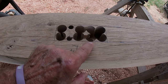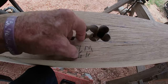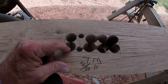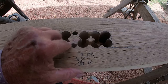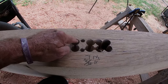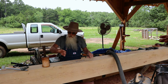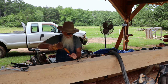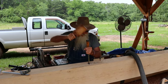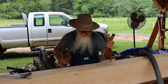I had one hole get a little close, but I looked and I did not go across my score line. I cleaned out the wood chips with my shop vac. Now I'll start with a chisel and just start taking this wood out, then set my combination square down to make sure I'm coming square off the top edge of this girder. I'm going to take a sharp chisel and begin to chop some of this stuff out — there's quite a bit of waste to get rid of in the middle, and I'm staying away from the line.